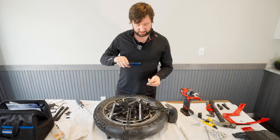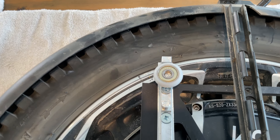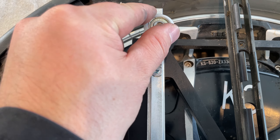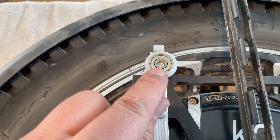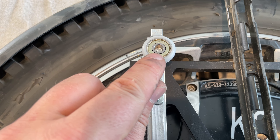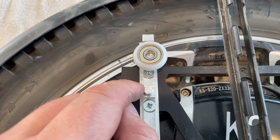The next thing we have to do is get our roller bearings and put them on. They're going to be tight, so I'm hoping to find something that can go around there to bang them down carefully, because if you just smash them down with a hammer on an angle, it could damage the bearing. We want this to be nice and smooth.